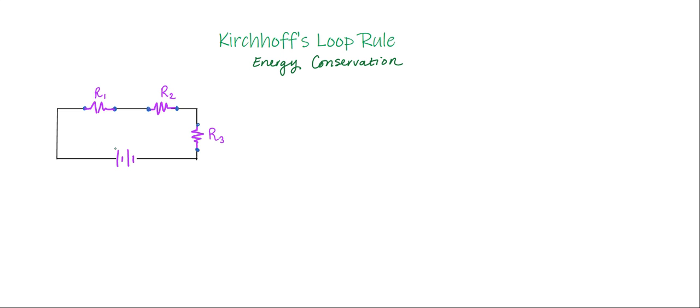We're also going to rename the battery now, the source of energy in a circuit, as the EMF. Now, EMF is actually an outdated term that stands for electromotive force and was used back in the time when scientists didn't really understand that the battery wasn't providing force to the circuit, but was providing a kind of work done or energy. But the acronym is still used to this day and is symbolized with this fancy letter E, which I poorly draw as a kind of backwards 3.